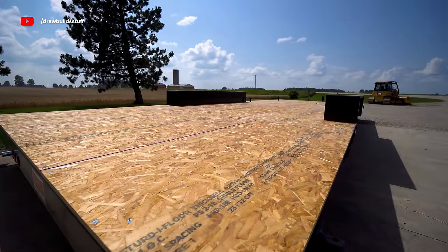Then I had to measure my corner post to length and then I cut it out using some aviation snips. This stuff can be a little tricky to cut because of all the complex curves and bends, but you can just cut pieces out of the scrap side of the piece, and then that makes it a lot easier to get your shears in there. But in the end, the bottom of the piece looks something like this.